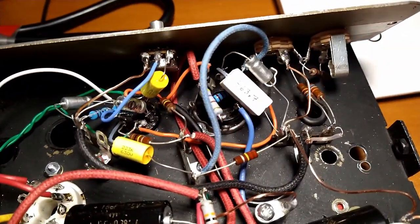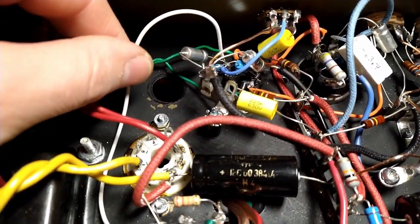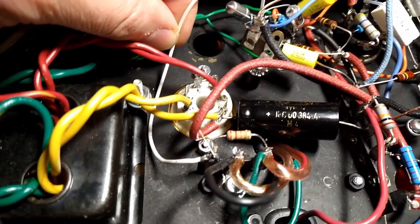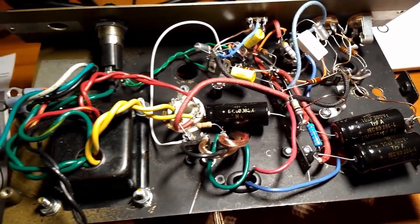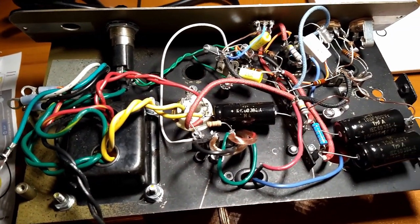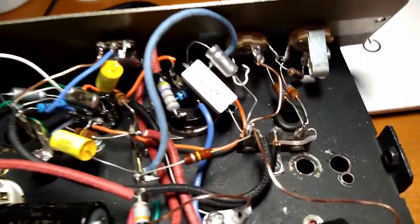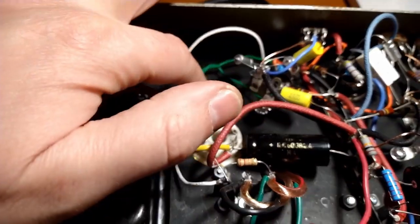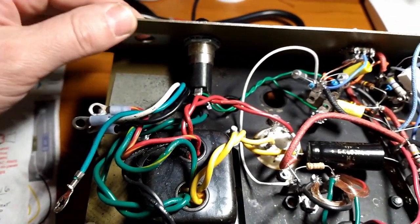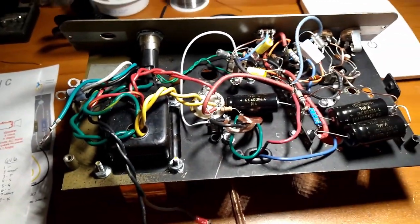It's probably going to be noisy. I got some grid wires going here and there. I have the negative feedback kind of next to the transformer and the rectifier, but we'll fire it up, see how it sounds, and if it's noisy and unruly, we'll address it then. But it should work, and it should be cool. So we just got to get a fuse holder back in here, an on-off switch, and then hook this up, and we'll be able to fire it up, see how we did.